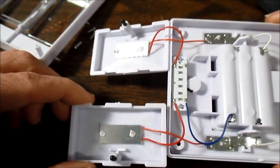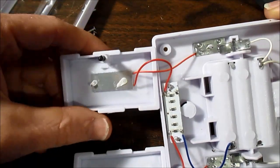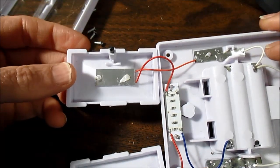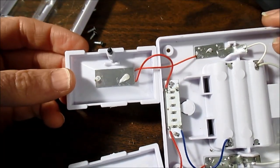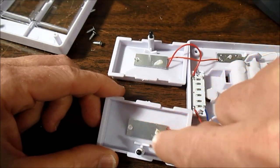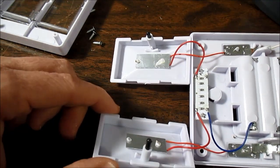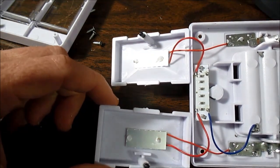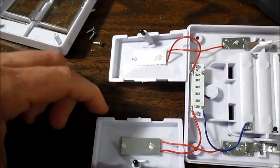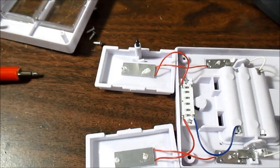So we indeed have some resistors in there. I'm going to have to look at how they're wired up. Looks like there's a few in series maybe. But the LEDs are on the front of this aluminum. Minuscule amount of heat sinking. But at the currents we measured, it's probably okay. Well, I'm going to see if I can trace this out here and see what's going on.